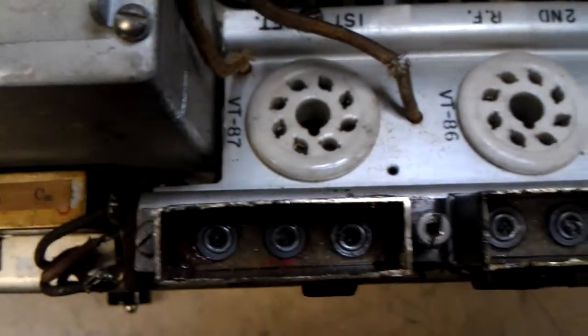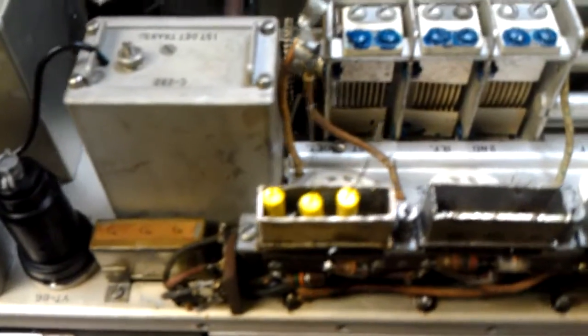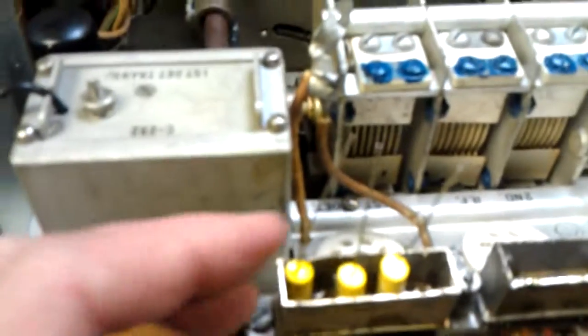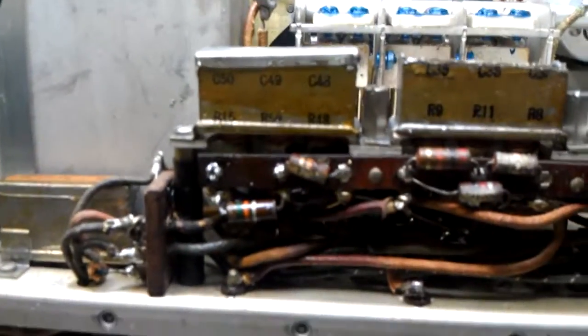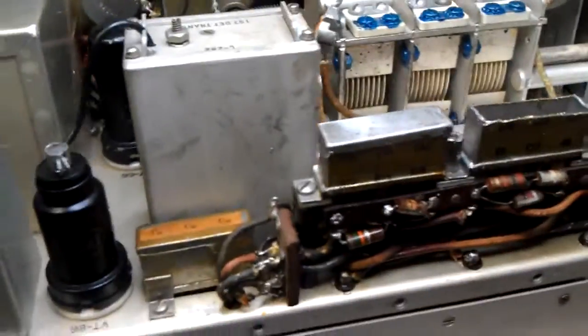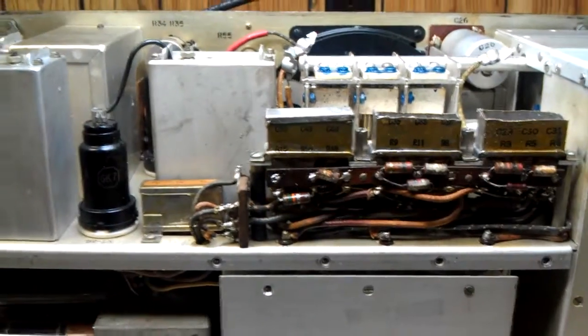That's going to work out good. I think we're ready to install the capacitors. We've got our three capacitors in — it didn't take but a second. We just cut the leads very short on one end and bent it over, then held it down while we soldered it. Now we'll join these three together and run them to ground and solder them on the edge. Got the first one done, got the lid on here, and put a little solder on each side.